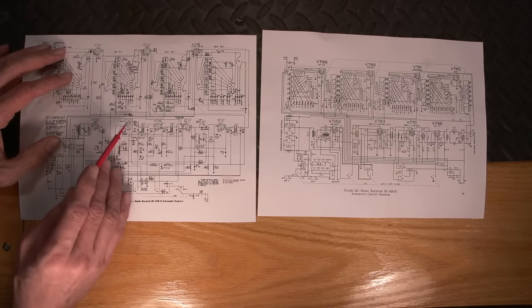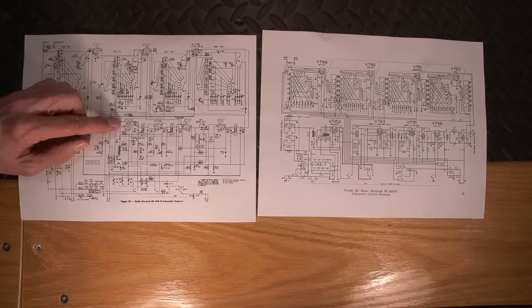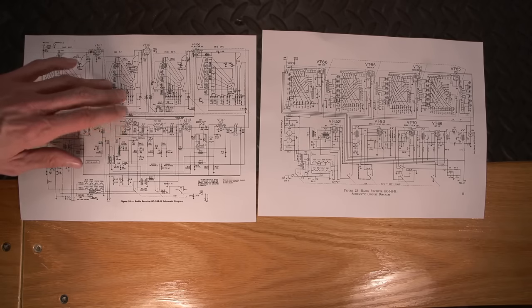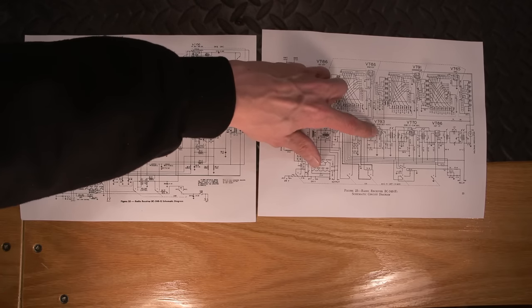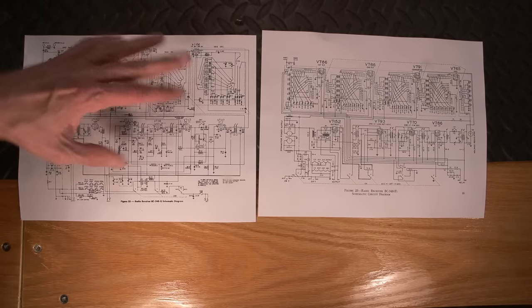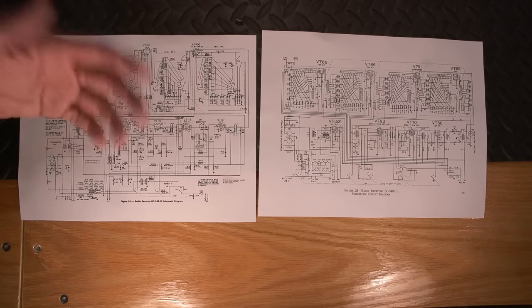So the VT233 has two diode plates in it. So it's actually technically three tubes, a triode and two separate diode plates. Something like a 6AV6 would be a standard type of detector tube in a modern type of radio. 6AT6, 6AV6, that kind of idea, but in an octal package here. And in this one here, you can see that we have our third IF, second detector, and AVC with the VT93 just itself right here. So you can really see they've kind of compacted things in this radio, and they're using a more modern tube set so they can get away with it.